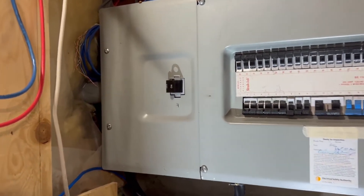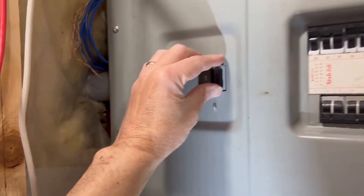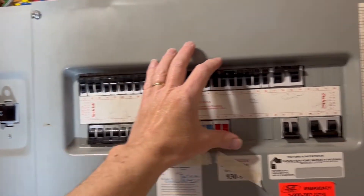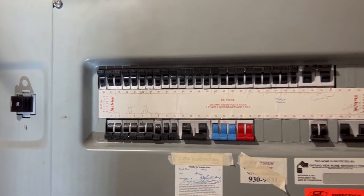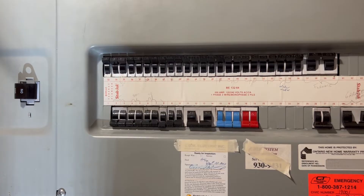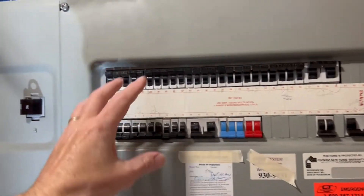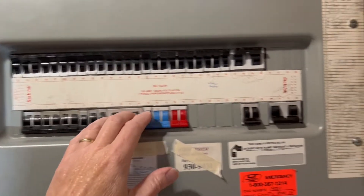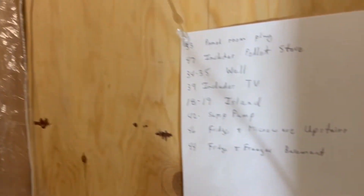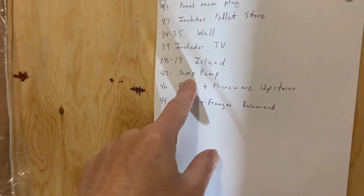Here I am in my electrical room in the basement. You can see my power comes inside from out and goes through my 200-amp breaker, which then goes through the two sides of the electrical panel. A generator or the Generalink cannot supply the whole house all at once, so you need to be able to turn most of these breakers off and only turn on the ones your generator can power. Over here on the wall I have a list of what's important to me, including the fridges and freezers, the sump pump, and my well.